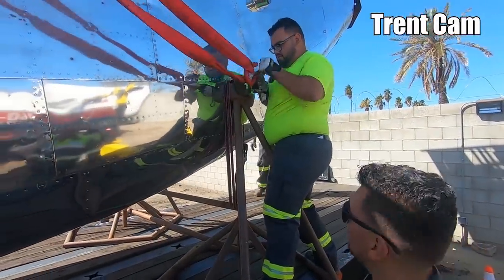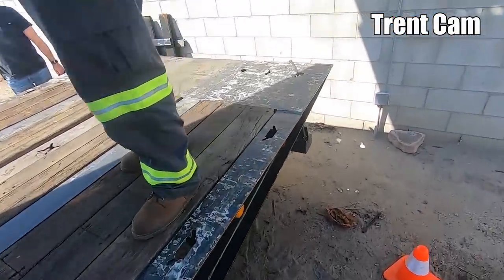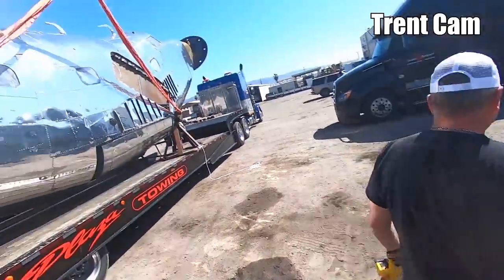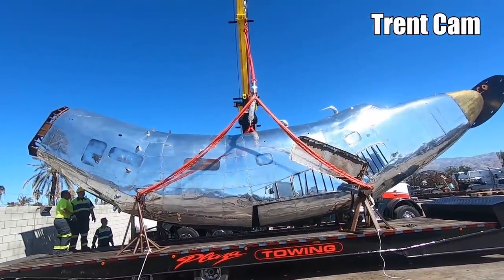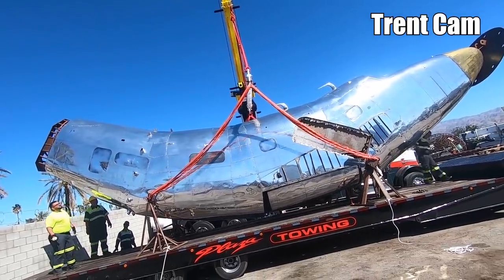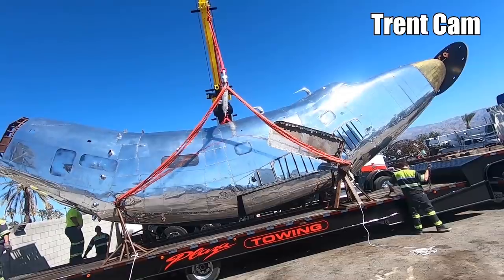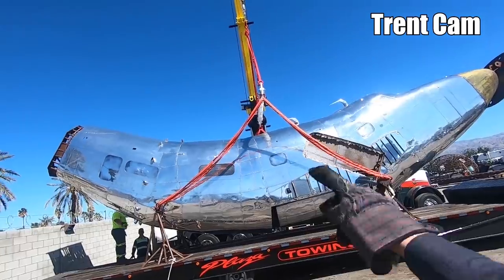Right, 20 foot strap, 16. Those are 12-ton shackles right there. If you're past those 45-degree marks, you're rated at half of that, so 6 tons. You have 12 tons there, so you'd be good for 24,000 on those D-rings. Our angle up there is all right.